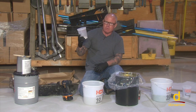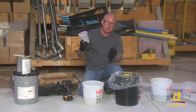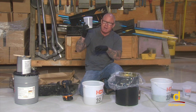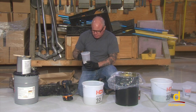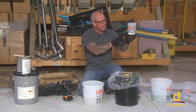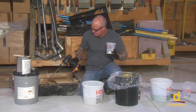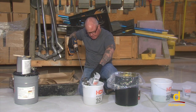Keep in mind the quantity was provided in the technical data sheets. It's really crucial that you look at the ambient temperature — it'll give you the chart or guideline of how much MMA hardener mixes into this Macrolix P12. We've determined we're at four ounces, just double check — I'm at four ounces here. Now we're going to mix for two minutes at slow speed.